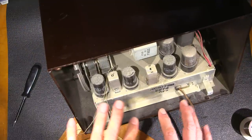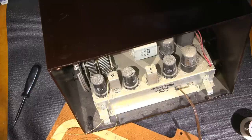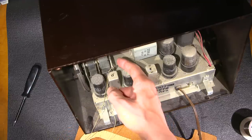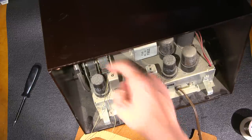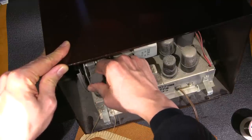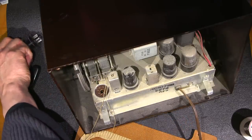Before I start removing all the screws on the chassis and removing the knobs and things like that, I want to make sure I can get this antenna out of the way without damaging it. So these are very fragile, and of course the tape on the backside is getting pretty old right now, so I want to desolder this wire here and the other antenna wire which attaches to the variable capacitor. So what I'll do is I'll gently remove the oscillator tube here, get that out of the way,